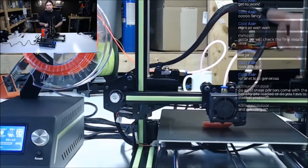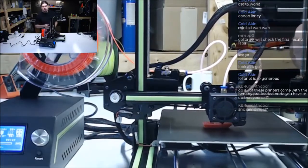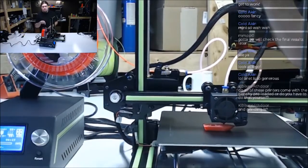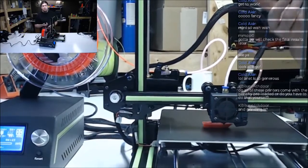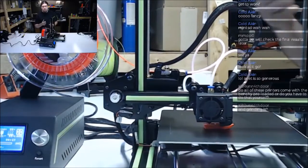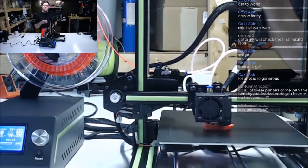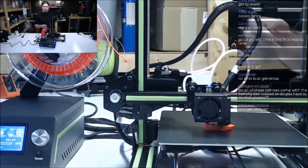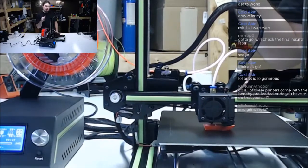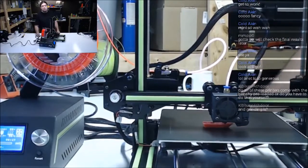There are acceleration and feed rate settings on all these printers, how fast you can go to make a certain move. And infill, the crosshatch inside, is usually the fastest movement. So you always see the grinding during the fast movements. And that's where we see broken infill, and the part will be real weak because the infill doesn't line up anymore. You start hearing a crunch, see it snap back when it's trying to do all that infill because it just can't get enough plastic through the nozzle fast enough.